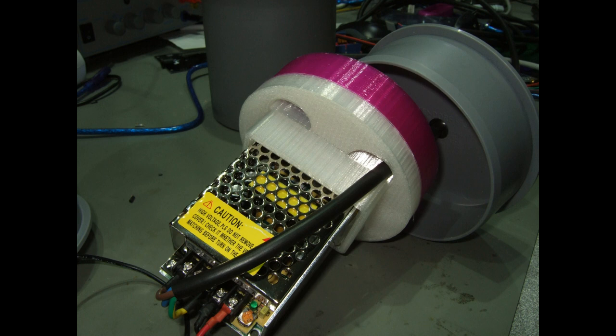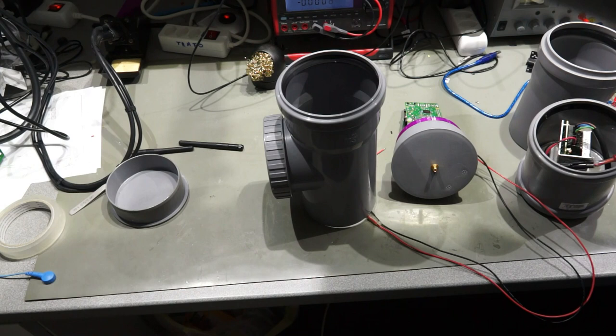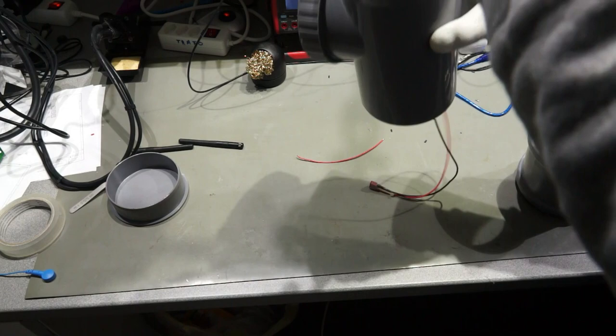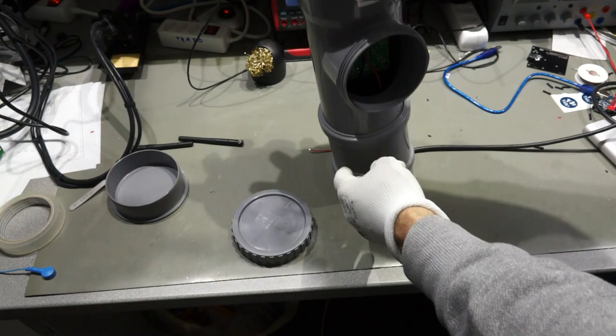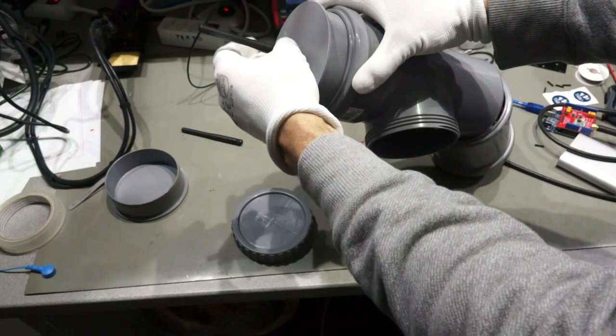The weather here in Switzerland is quite wet and therefore I first have to finish my gateway. As my colleague Urs, I use wastewater piping for that purpose because it is waterproof for the obvious reasons and quite cheap. I use some 3D printed parts to fix the gateway and the power supply inside the pipe. Because I have a 240V outlet close to the area I want to place the gateway, I decided to use one of my small 5V 5A power supplies. The connection to the internet is done via Wi-Fi, using a small dongle in the Raspberry Pi.